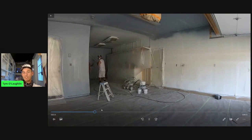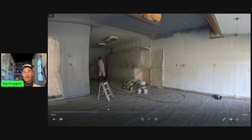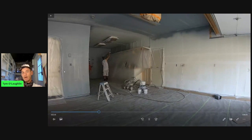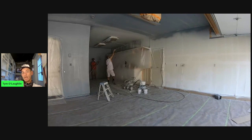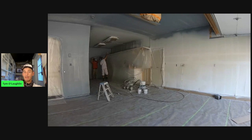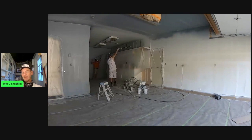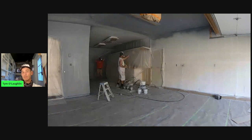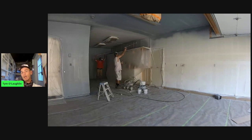This project is an interior garage. A lot of houses in my area when they're built don't always finish the garage — they just sheetrock it. It's a raw sheetrock project and you've got to come through and prime it. You're dealing with raw substrates: the paper side of the sheetrock is showing, as well as raw taping mud, tape lines, and so on.